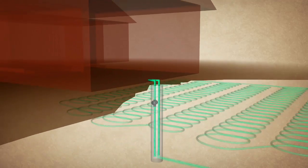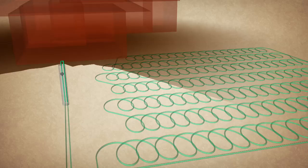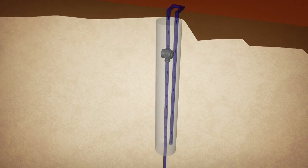The key component for any geothermal heat pump is to have some interaction with the ground, so it needs some sort of well. One type of well is a closed loop filled with antifreeze that circulates horizontally about 5 to 10 feet below the surface. Or you can install the same closed loop of antifreeze vertically into a well that may go down hundreds of feet. A third option is an open loop in which groundwater — not antifreeze — is pumped out of the ground through the heat pump and then returned. The key for any of these loops is that we're always going to find 50-degree temperature both winter and summer under the ground.